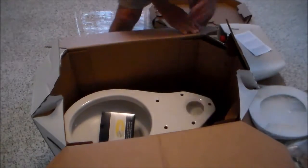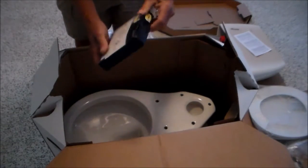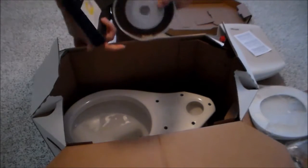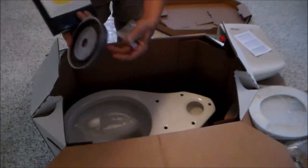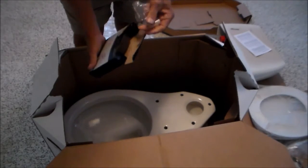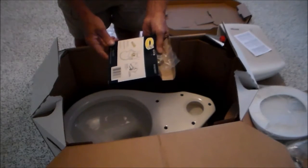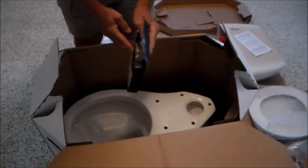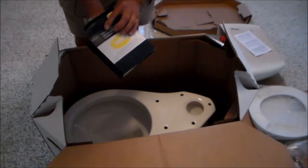And this comes with its own seat and the wax ring. Now this I'm not going to use — I'm going to get a different type. Here's the new bolts. What I don't like with this is it doesn't have the neck that extends. From past experience I found that these type seem to leak a little more readily than the one with the extension. And they're fairly cheap — I would think a new one is going to be less than $5, usually about $2 or $3.